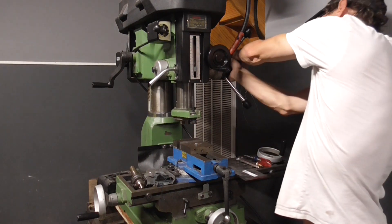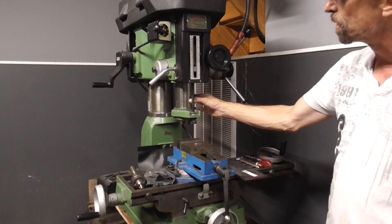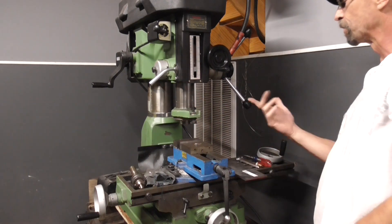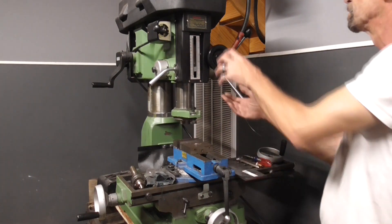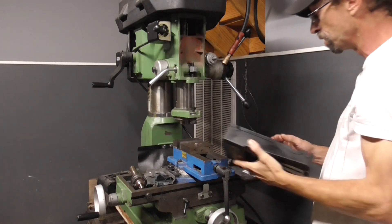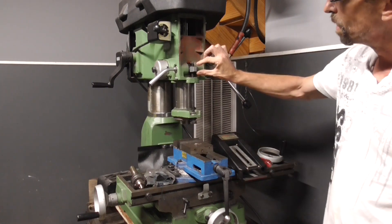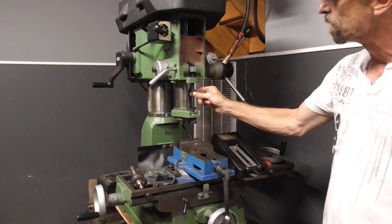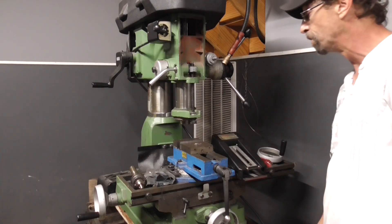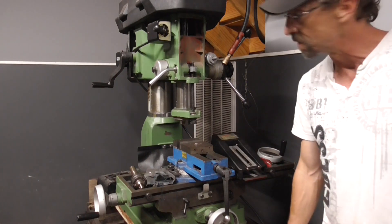What I ended up doing is freeing the mounting up so it's not attached to the shaft anymore and is allowed to move a little bit, then locked it down. On this smaller mill I would probably do the same thing — lose the little cover, mount the scale and reader head inside, stiffen it up, free it from the shaft, and then control the Z axis properly. Let's get set up on the gearhead mill and start taking things off to see how it was put on.